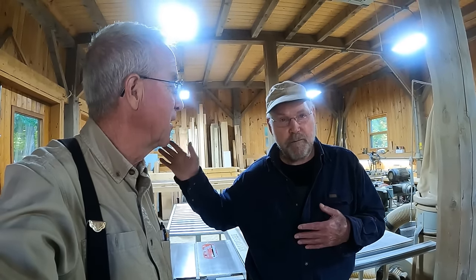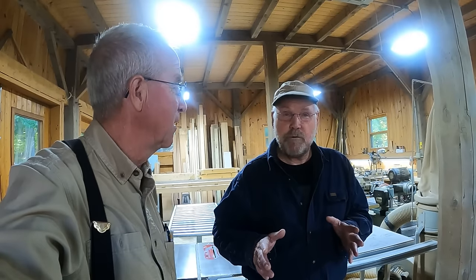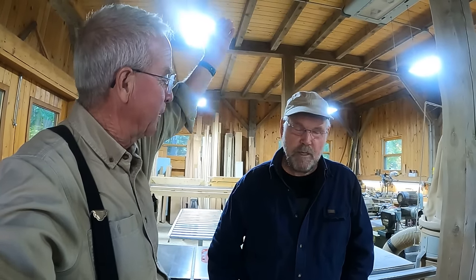Okay, you cannot assume that the dimension from the sawmill is the dimension you're anticipating, so you've got to fight every connection, right? But there are different methods which I've learned over time that work much more efficiently. The other method is called the square rule method, which I primarily use now for my newer frames, but scribing is a very effective way if you're one or two people and you can relate the differences in the thicknesses or widths or dimensions of a timber to the other person. So communication. You gotta be able to communicate on the job, on the fly. The other guy knows exactly what the problem is. Exactly. It's like calling out sheetrock measurements. You got one guy in the scaffold, one guy on the ground.